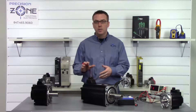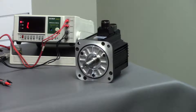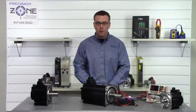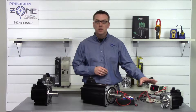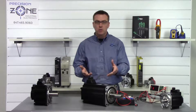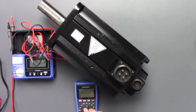Now that we've gone ahead and eliminated the fact of this motor being grounded, let's go ahead and perform a phase-to-phase resistance test. I'm also going to be using a quality digital multimeter for this test, and I'm also going to be showing you some differences between a milli-ohm meter, which is the most accurate way to perform this test. But for in the field, you can use a digital multimeter to get you close. So we're going to go ahead and turn our meter to the resistance setting.